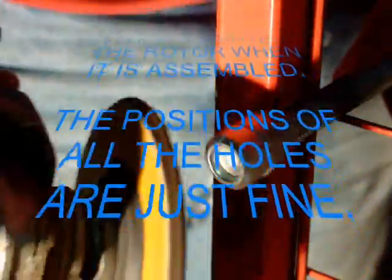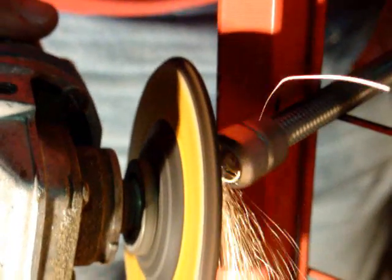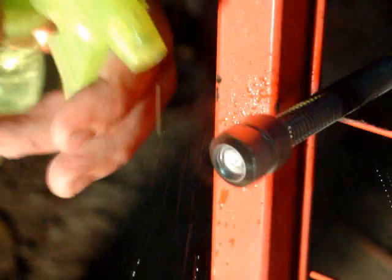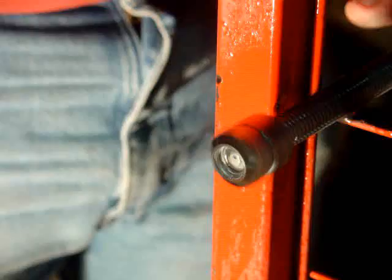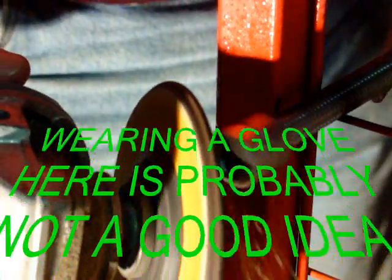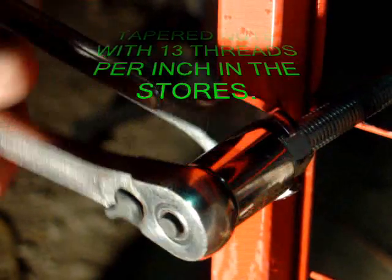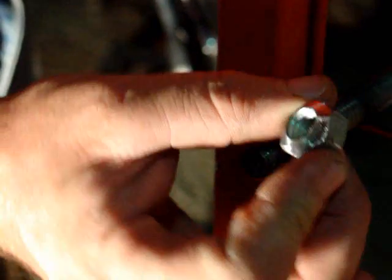It's coming along fine so far — it's going to get hot. Right about here you're going to see a lot of steam come off that. I don't want to get this too hot; it'll ruin the temper in it and you'll anneal it and make it soft. Back to it. This would burn your hand. Looking for the water — look at the nice lines in that, just like regular machine work.